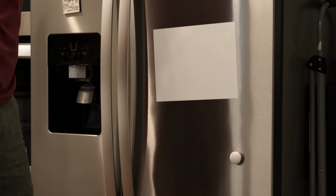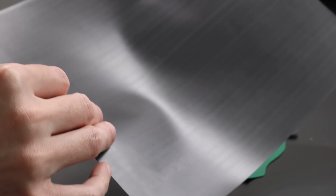Each one has a magnetic sheet below the vinyl. The magnetic sheet triggers that magnetic switch that we talked about before, and that sends the signal to the microcontroller that it's time to check what the color sensor is seeing. Then the color sensor takes its raw data, processes it through the neural net, and basically makes the car do certain actions or no actions at all, depending on what it sees. It works. It's pretty cool.